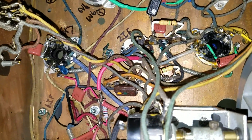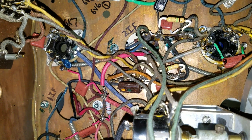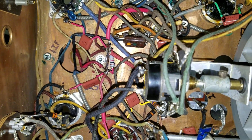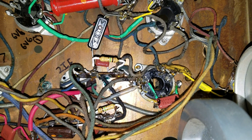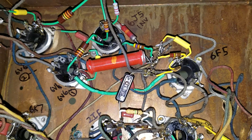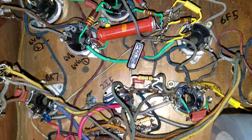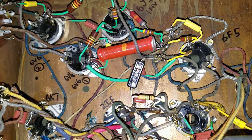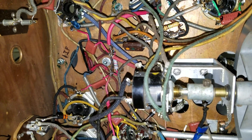I like to use the Panasonic 630 volt film capacitors for the small capacitors. They work out really well and they're pretty cost effective — I buy them in bulk at a good discount. There's a little wire-wound that looks like a mica mold capacitor that was perfectly within spec, and that big 3-watt resistor was within spec too. Other than that, all the other resistors are new. I personally like to use shrink tubing on just about every lead I put in the radio. They're a lot easier to see than bare wire, so when I'm troubleshooting I can find them easier and trace down wires faster, and I can color-code stages of the radio or the B-plus — there are all kinds of things I can do with the colors.